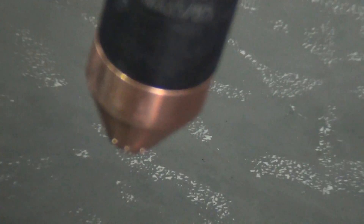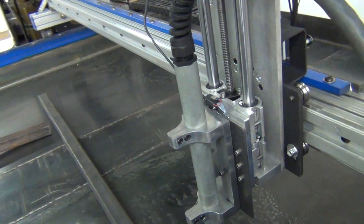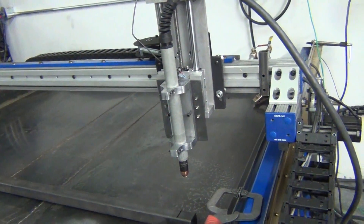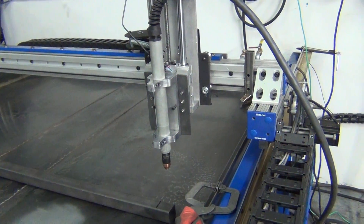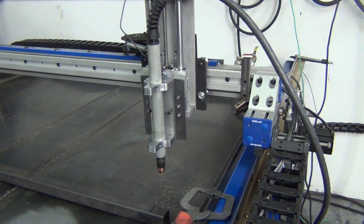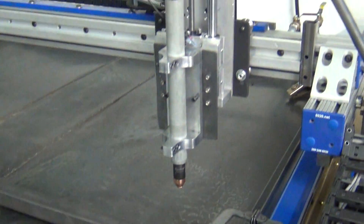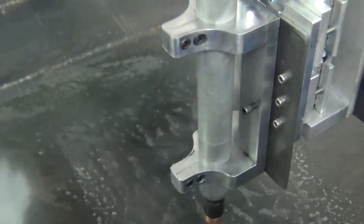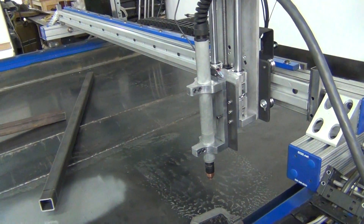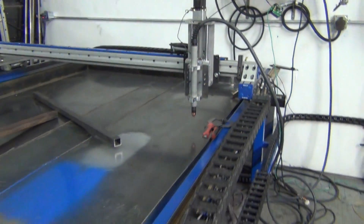So there you can see it doesn't take a whole lot of force. No damage to the torch at all. On the website for the magnets they have listed the amount of force it takes to pull off, so I just kind of took a stab at it and this seems to work really well. I think it's a good balance of the force keeping the torch mounted versus the force it takes to get the torch to break away. I'm really happy with it so far and we'll do some more testing this weekend.